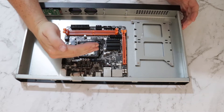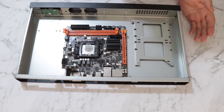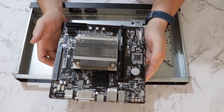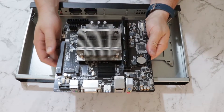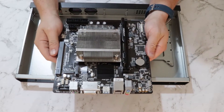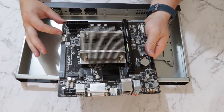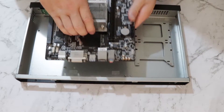I considered ducting airflow around and out that way, but then I realized that a while ago I bought a motherboard for no reason except that it looked cool. This is the Gigabyte GA-B150M-PIO SI revision 3. It's a PIO motherboard, which is bigger than mini-ITX. You can see there are two sets of mini-ITX mounting holes; the PCIe slot isn't at the bottom like it should be — it's up here at a right angle. It is slightly deeper than mini-ITX, but everything goes in the correct direction.